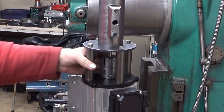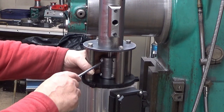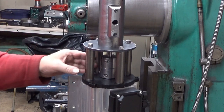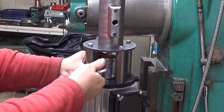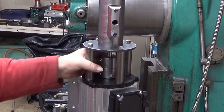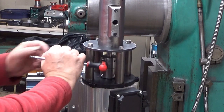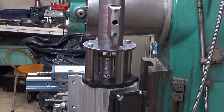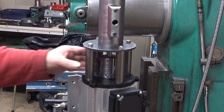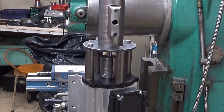And now, since it's loose from the shaft, from the pump, it goes like this. But actually, the motor side of that coupling is fully tightened at the moment. So I can tighten these and it starts to rotate the pump. And it's still quite easy to turn, so it doesn't bind. Let's tighten these. Yeah, it doesn't start to bind. Very good. There you are. Yeah. So, there it is. All it needed is half a millimeter from the diameter, so that there is some very negligible wiggle room, and then after this it freed up. So, well, yeah.